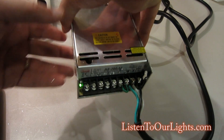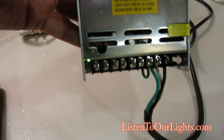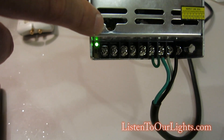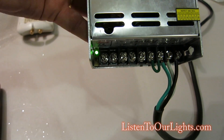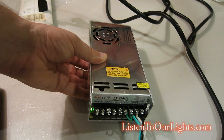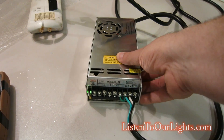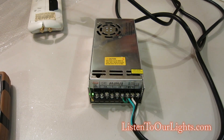If for whatever reason you think it's a little too high or a little too low, look in this little hole — there's a screw in there, it's hard to see. Get a little screwdriver and give it a little quarter-turn in one direction or the other until you get the voltage to where you like it. And that's how you hook up the AC.